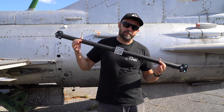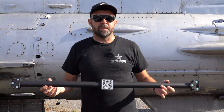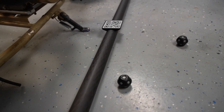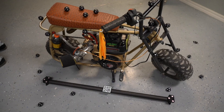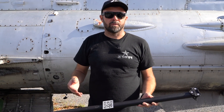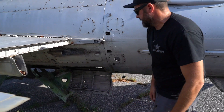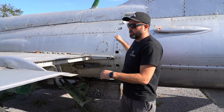The HandyScan Max Elite comes with two calibration tools that allow the scanner to calibrate itself every time you do a scan. You can either magnetize these to the side of something or just lay them on the ground near it. As long as you set it up so the scan knows exactly where these are and knows the distance between the two, that gives it a real-world reference point and ensures the rest of the scan matches up to that reference — so it'll all be the perfect size. In our case I'm just going to lay it on the ground right there, and since we have some dots down there we'll be able to scan it and let it calibrate while we're scanning the rest of the dots.